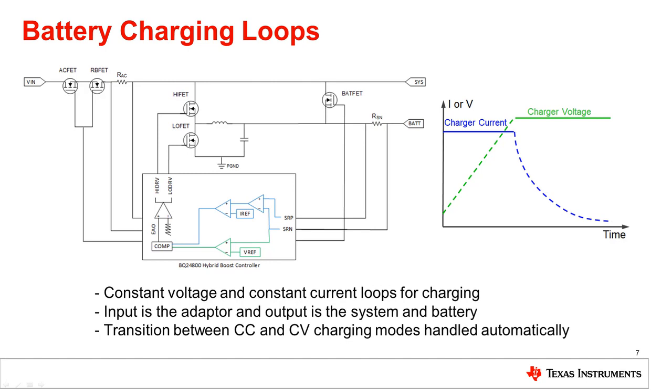Taking a closer look at how this is accomplished, it's via two independent control loops. The constant current charging control loop is driven from a differential amplifier that measures the voltage drop across the battery's sense resistor. For a known resistor value, this provides a current measurement. The measured current is compared to a reference set via SMBUS in the charge current register, and the difference is fed into an error amplifier which adjusts the PWM duty cycle. A similar mechanism handles constant voltage charging: instead of measuring across the sense resistor, the SRN measurement — the voltage at the battery's positive terminal — is compared to a reference in the SMBUS charge voltage register to control the buck regulator output voltage. The same two control loops are implemented on the BQ25710 using its SRP and SRN connections.